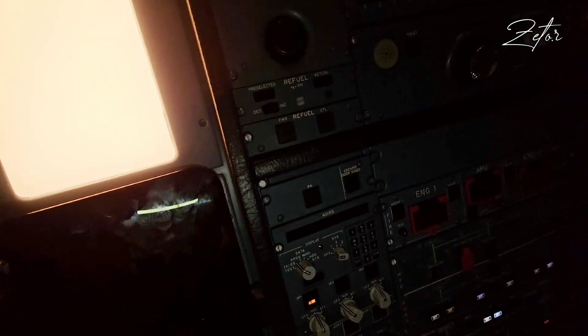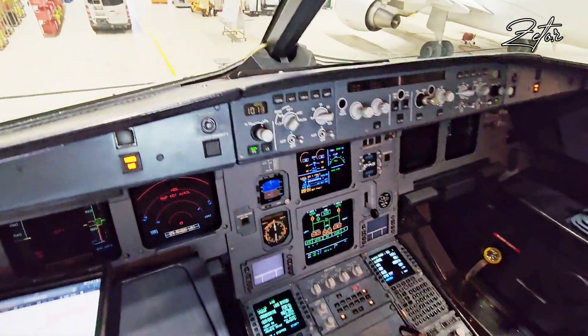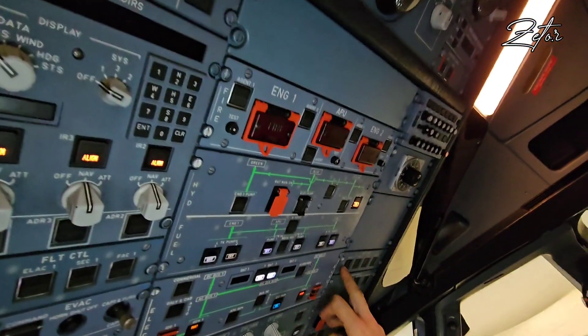Then I am going to continue in the cockpit — I need to activate the SEC and perform a test which will prove that the spoilers work as supposed to. For that I need to activate the ADIRS systems and all three hydraulic systems, retract the flaps, and then cross-check that all spoiler and elevator computers are on.